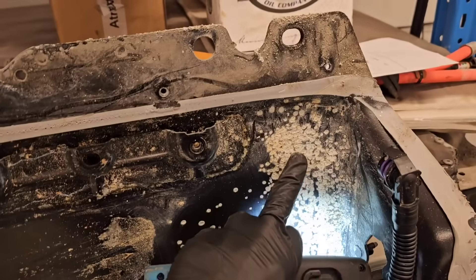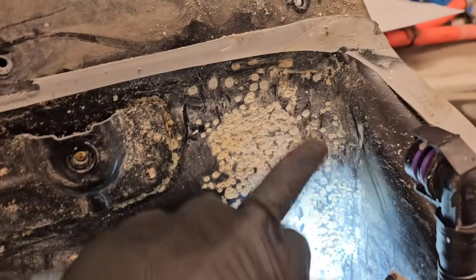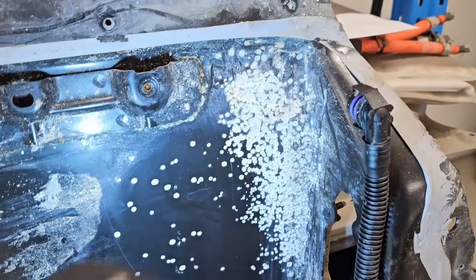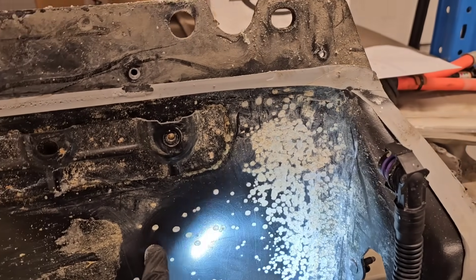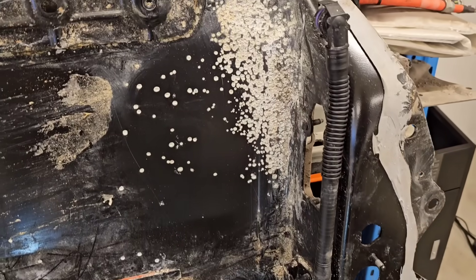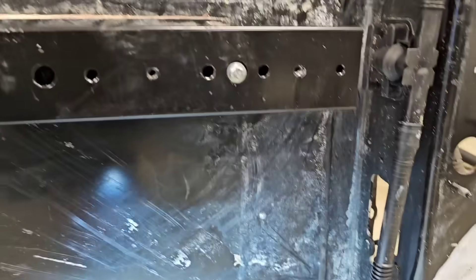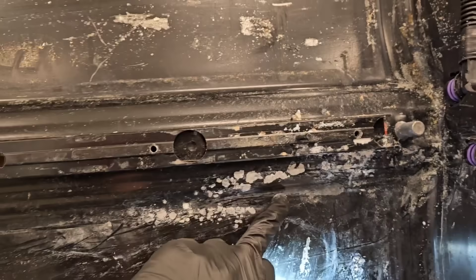When we started to look more carefully, we thought: what the heck is this? Why is it so corroded here? We're thinking that this corrosion is because of liquid which probably leaked out of the cell. I don't know how possible that is, but we can't explain it any other way. And we've seen the same thing on another module here too.